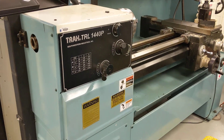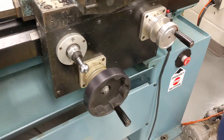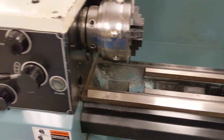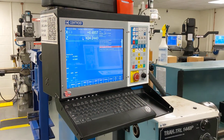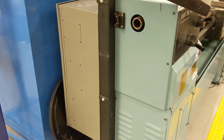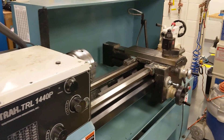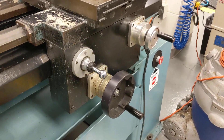First up is a Proto-Trac TRL 1440 flatbed lathe. We've got this lathe here, originally equipped with a Proto-Trac control. It has a bunch of nice hand wheels and jog buttons on it, and running it now is a Centroid T400 CNC control. This was a retrofit — there's the Centroid cabinet in the back with a Centroid all-in-one DC controlling the original stock DC servo motors that came with the Proto-Trac. All these controls have been retrofitted into the Centroid T400 control as well. Pretty cool.